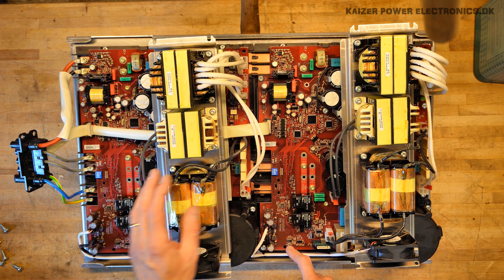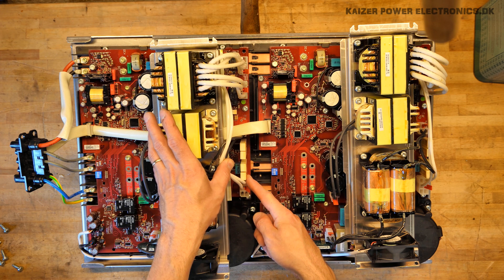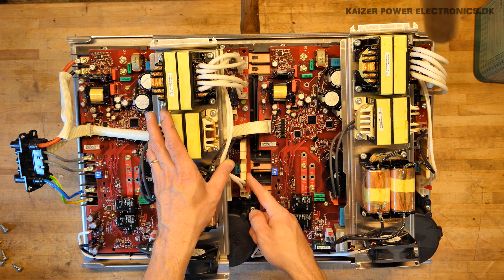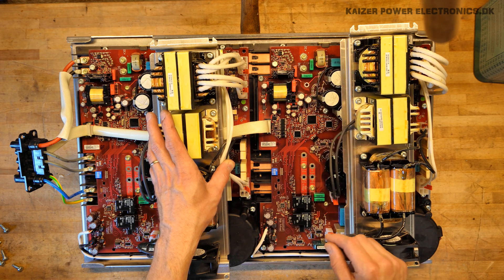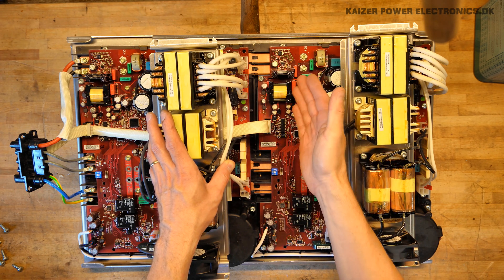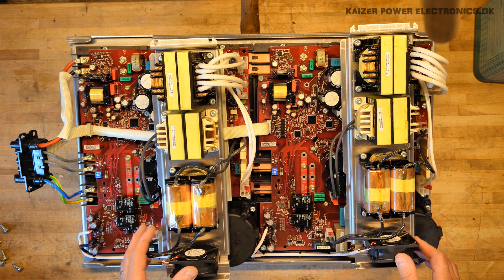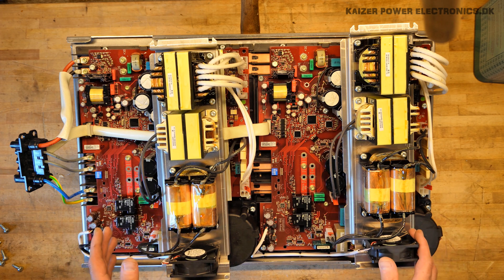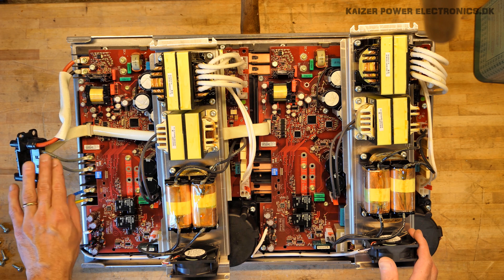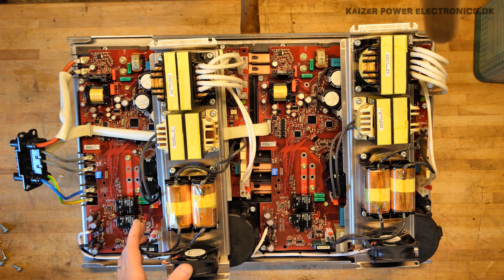I have a few issues with this. We have four large power resistors sitting here — they are completely brown, dipped in conformal coating. We have a heatsink over here that's completely soaked in conformal coating — there's no way that has its original rating anymore. A few other things that jump out straight away: it is two-phase, as expected from the model number, and it has some good markings on the PCBs.